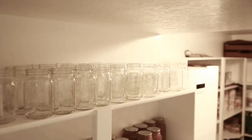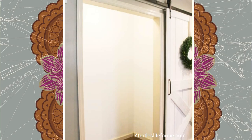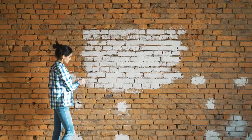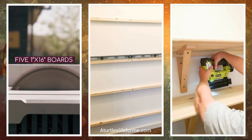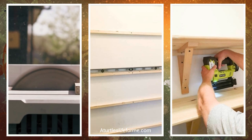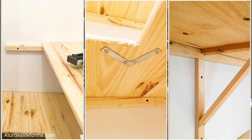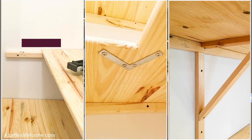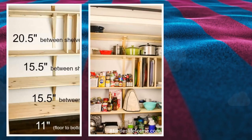Number 1: How to Build Your First DIY Pantry from Scratch, Complete with a Barn Door. Start by emptying the space of its previous contents, then prep the walls with new paint if you want to. Next, cut five 1 by 16-inch boards to the width of the pantry. Keep your level bar handy as you attach 2 by 2-inch pine cleats into the walls by driving 3-inch wood screws into them. Secure the shelves on the cleats with 2-inch brads. You can add diagonal bracing in the middle for better structural strength. Routing the outer edges is optional but would make them look more stylish. Finally, install the tracks above the doorway outside and attach the barn door.